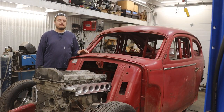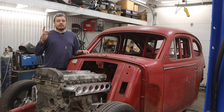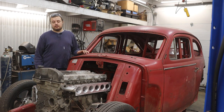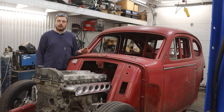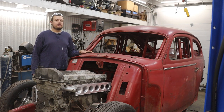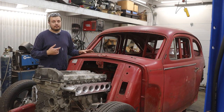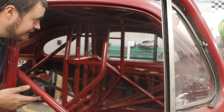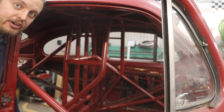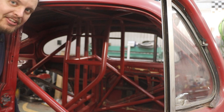Last up is our 1959 Volvo PV544, and this is the current build on our channel. We are in the process of swapping a Vortec 4200 with a turbo into the car, and this will hopefully be our quickest and fastest 4200 powered car yet. Because we plan to go very quick in this car, we needed quite the cage. And something we learned from doing our first 7.50 cert cage on the Talon is there really is no reason you should ever do a 7.50 cert. What you are looking at here is a 6.50 cert roll cage, and it really doesn't look very different than a 7.50 cert, because there is not a lot of differences.